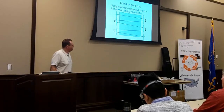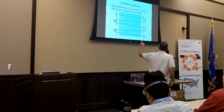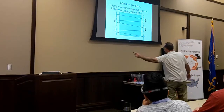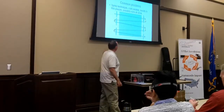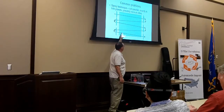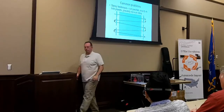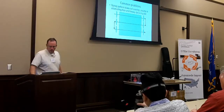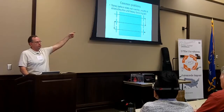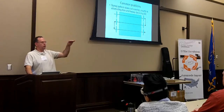Some common problems in paint technique: zigzags — if you're going left to right, the first pass is great, but then you drop down on an angle instead of staying parallel, and it's back and forth, leaving thin spots where the paths get wider apart. Another problem is dropping down too much, resulting in a wet, dry, wet, dry, wet, dry pattern across the surface. You want a consistently wet application of paint.